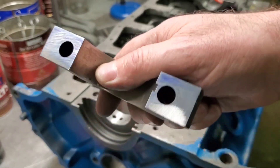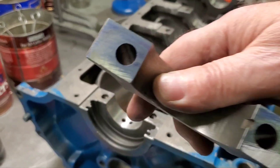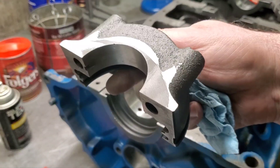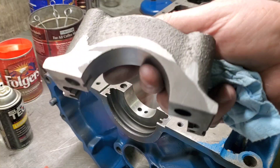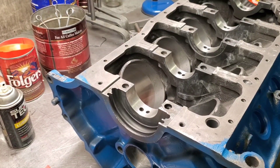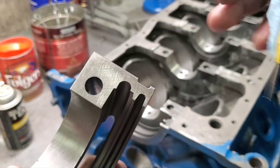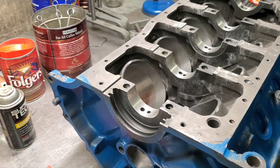I just put this in the cap grinder to show you where it's touching — it's touching on the edge, so we're going to have to fix that cap and straighten it up. The caps were obviously machined crooked. You can see how coarse-ground those sides are — they're never very precise. But now we've got a good contact area all the way around in my fixture. I can locate it there and it will set up at 90 degrees to the face. First cap — case in point — we're touching right in the middle. I've squared that cap up.